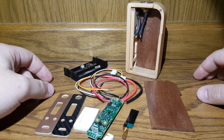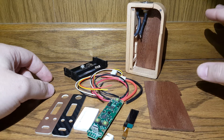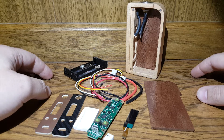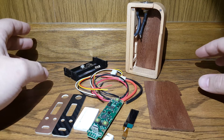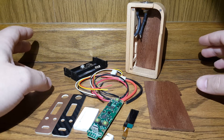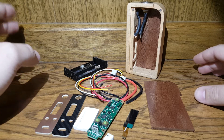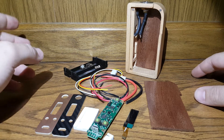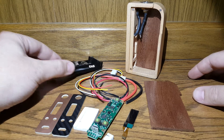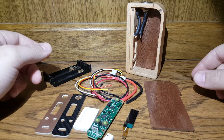With the 3S lipo, if you're a 100-watt-plus vaper, having that 3S lipo is going to be nice. Your battery life will be comparable to using dual 18650s — say a 900 milliamp-hour 3S lipo pack might be comparable to running a single 18650 at 2800 milliamp-hour at that high rate. But I don't vape that high, and I kind of prefer having dual 18650s — pull them out, charge them, switch them around if I need to.